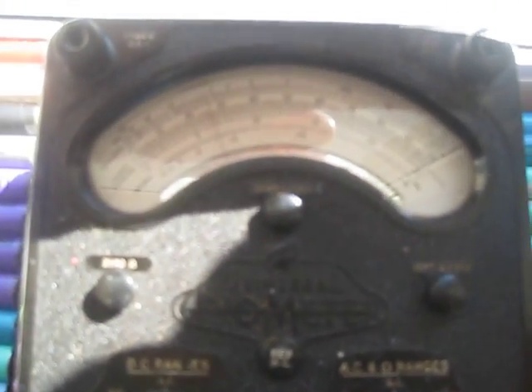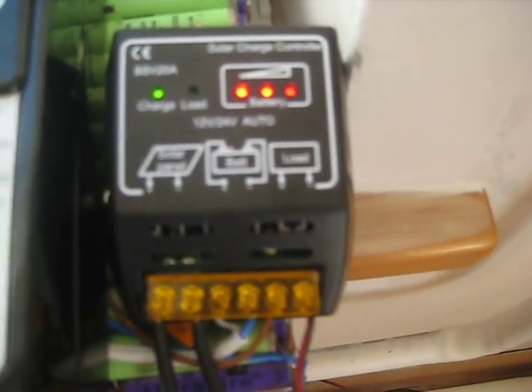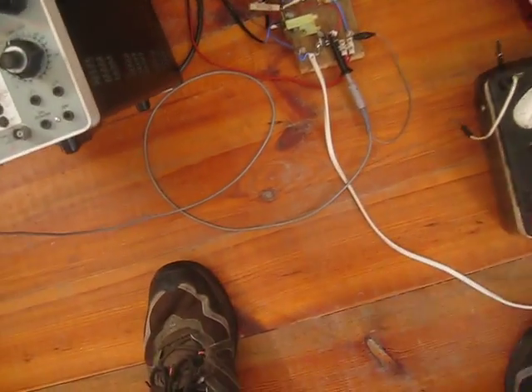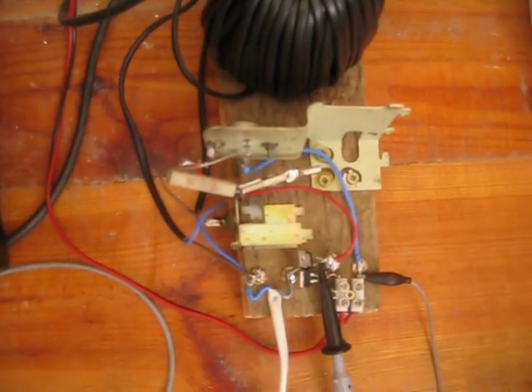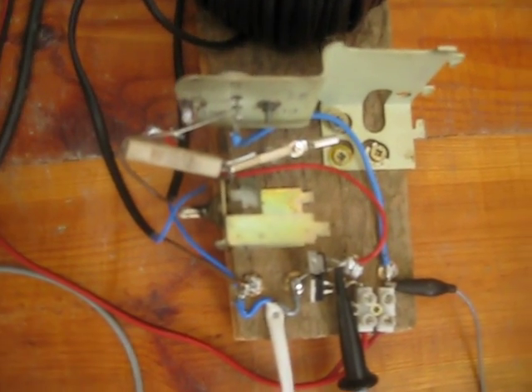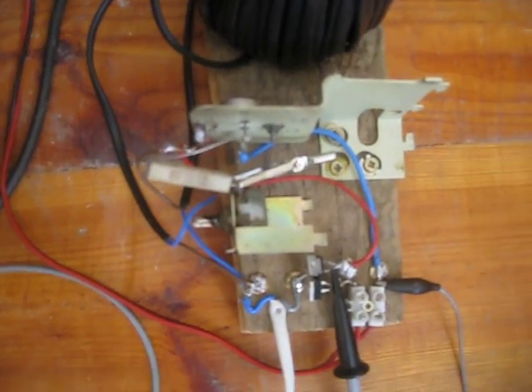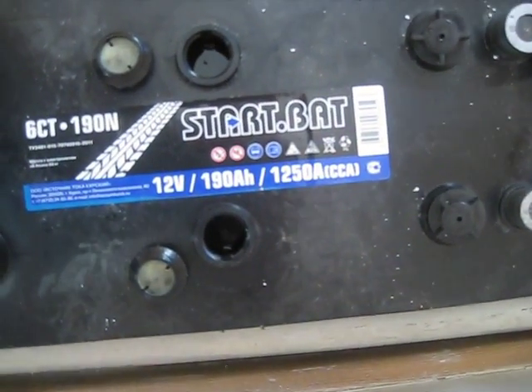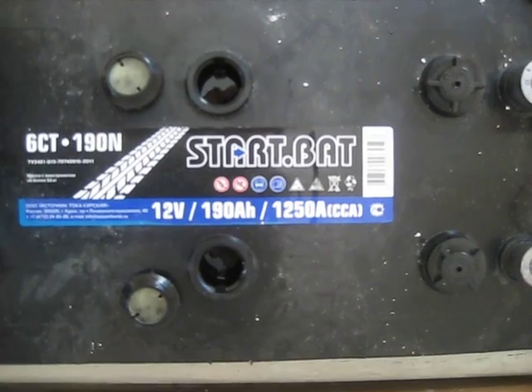The voltage on the battery pack is 26.5 volts. It's running through a charge controller and using 2.1 amperes of current. It uses an old 2SA117 transistor and a 33-ohm 10-watt resistor, which gets really hot — I can't touch it — but the transistor stays cold.